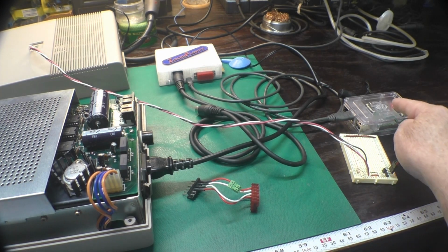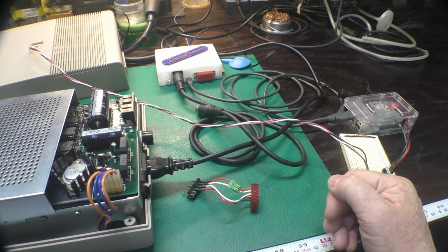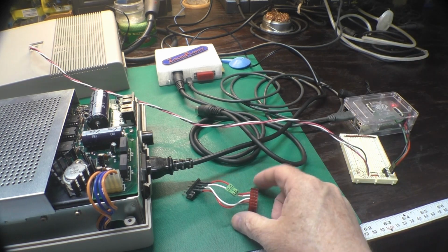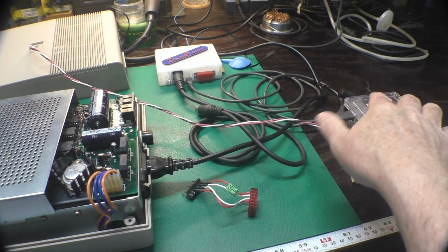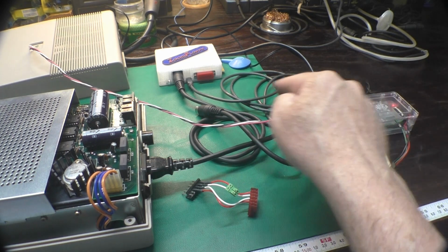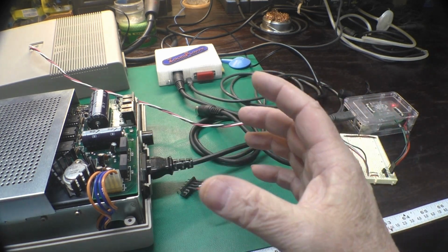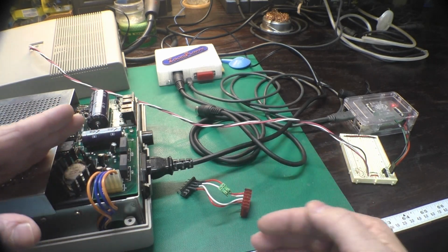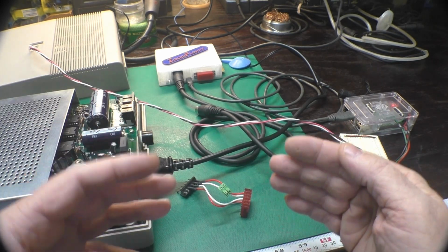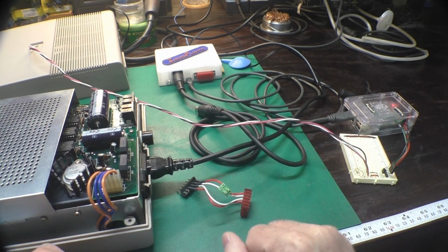And I dug out the Raspberry Pi I had been using for that, and I updated it. And I decided, well, since I was going to be using a Raspberry Pi for data logging, I will get out my Zoom floppy and build OpenCBM for the Raspberry Pi, so I can also control the 1541 through the Raspberry Pi. That way I can write one Python script that will control the drive and do all the data logging. We can kind of make this an automated experiment, and it's something that anyone can replicate.